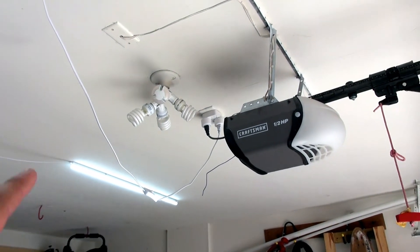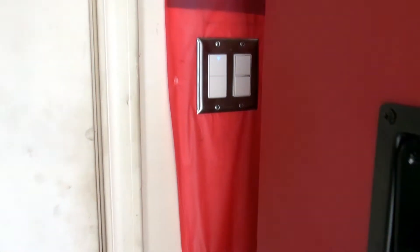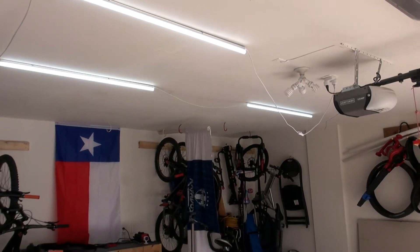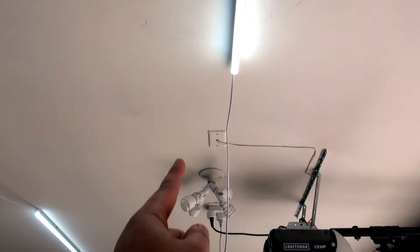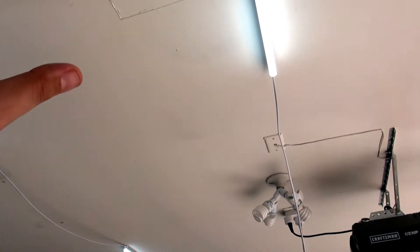I really don't have much use for that switch for those lights over there, and they're yellow so I don't care about that. The outlet for that one is actually right here - the bottom one controls that light. So what I'm gonna do is run the line through here. I already used my stud finder and found my two studs - you can also clearly see them in the garage. There's a stud on this side and a stud on this side, so the wire is gonna run this way and I'm gonna tap into that and use that same switch.